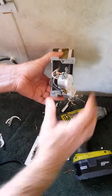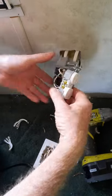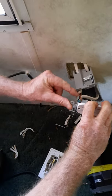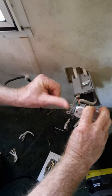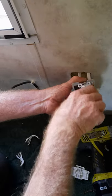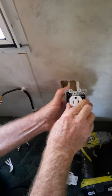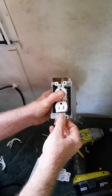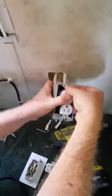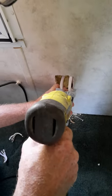The new outlet is connected — black to the gold, white to white. That bare wire goes to that green right there. I'd like to leave these things loose until after I get it all hooked up, because these little tabs are not very strong, and a lot of times you'll pull through the sheetrock.